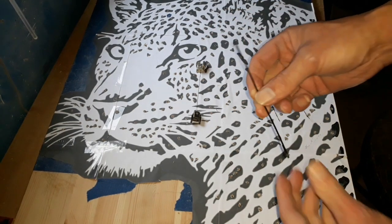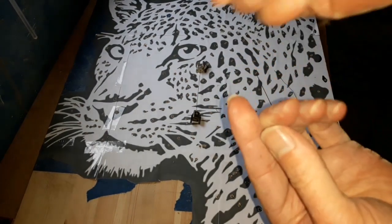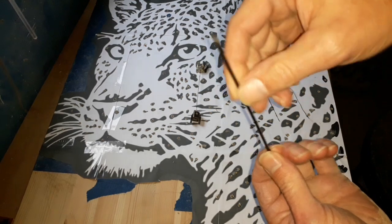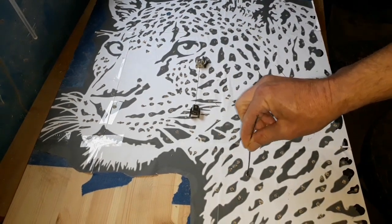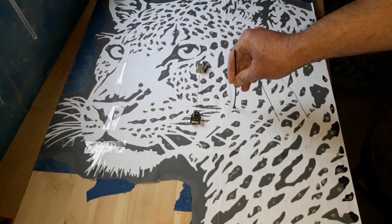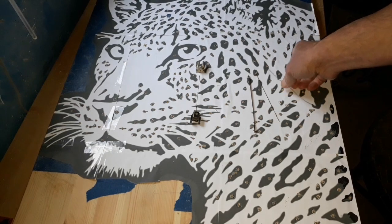Your normal blades, your pin blades, you obviously can see they've got a pin on the end like that, both sides. They will literally hook onto a hook, the top and bottom, and tension them up. Downside to pin blades, you've got to have a big hole to feed them through. Now on most of these you would get away with it, but when you're down to these little pinhead ones here, you're not going to fit them through. So you've got to use pinless blades.